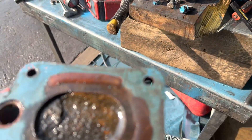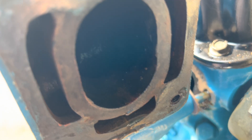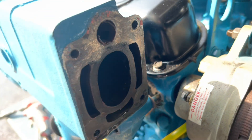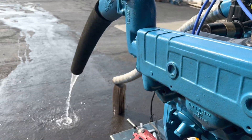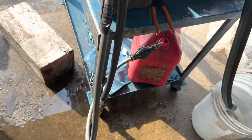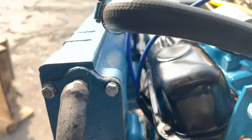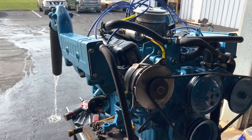I took the plate off and the gasket is breached right there — you can actually see the rust line where water was going in, right there on the bottom. That's why it was filling up cylinder two. We'll put a new end gasket in and it should be good. I replaced the gasket and now we've got good water flowing out. I've got my hose hooked directly to the manifold and nothing else is coming out, so we'll slide this manifold back on and retest it.